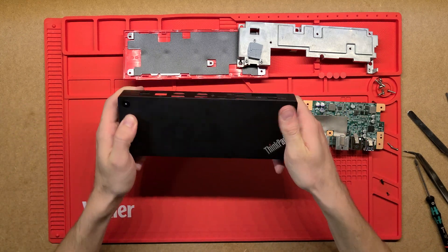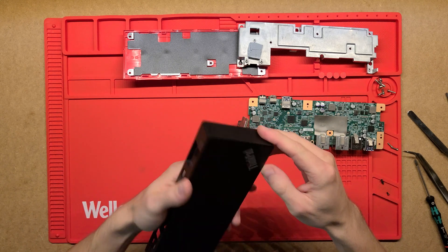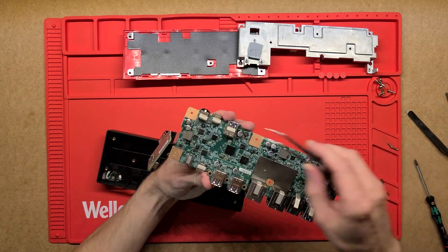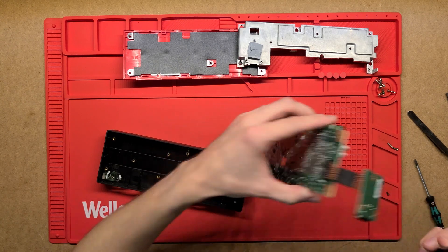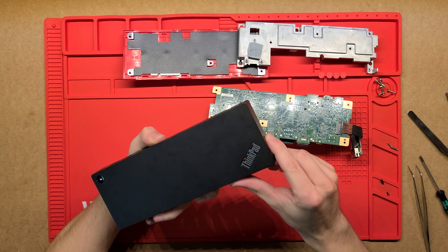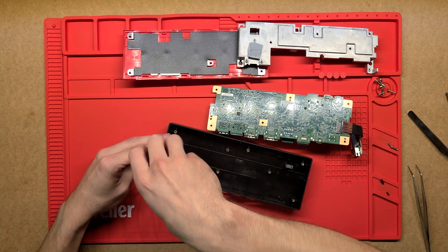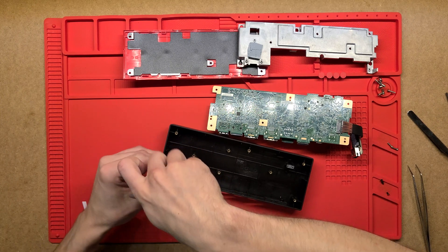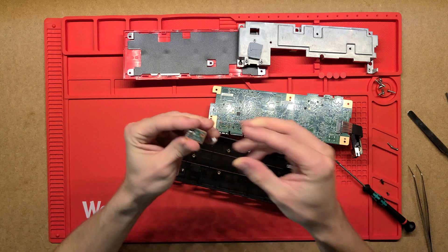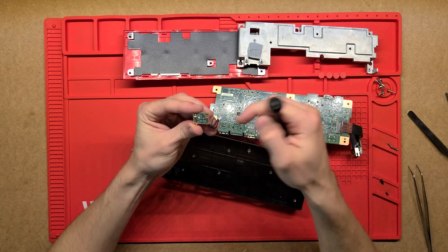There's just extra power there as well, and then this is just soft plastic. This little connection here is just for the button — a little tactile push button that turns the whole dock on and off. And there's an LED here, so there'll be an LED on one board. There's a tiny little LED over here with a little foam padding on the side, and this will be a translucent channel all the way through to actually channel the light up to the top, so the little dot on the outside lights up. As well as the button, it's got two LEDs — LED 9 and LED 10, labelled there — so it must be two colours. They've gone with two physical LEDs instead of one multicolour LED, which is probably cheaper to do.